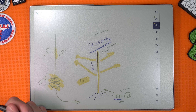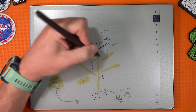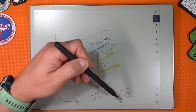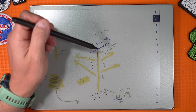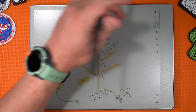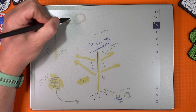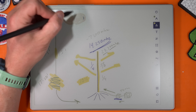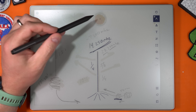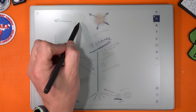So what about the other side — the 28.300 MHz side? That's a little more interesting. Within this antenna you do have a length of wire that is one-quarter wavelength or maybe five-eighths wavelength of 28.300 MHz, so it will radiate, and you can use a transmatch to help. But by having a longer antenna than you need, you now pick up something that's also undesirable. If you remember the antenna pattern for a vertical antenna — you've got a wire and two lobes — it's going to radiate omnidirectionally, giving you just a circle when viewed from the top down. You also get the added benefit of low takeoff angles.